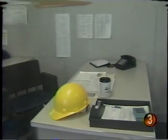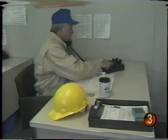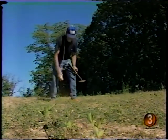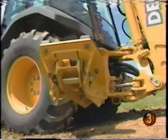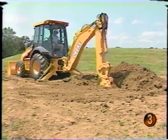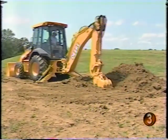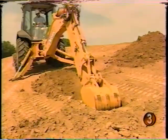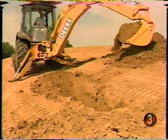Before starting work, be sure to call the utility services in the area to have the job site marked for underground lines or structures. In most areas there's a free or low-cost one-call locator service. It's better to take a little time before the project begins to know what you may encounter — if you cut through an electrical line or gas pipeline, you could be losing more than a little time. When setting up to dig, be sure the stabilizers have a solid base to rest on. To help prevent cave-ins, place the spoil pile at least three feet away from the excavation, even farther away if the excavation is deep. In loose soil, the spoil pile should be placed even farther away. When digging on a slope, place the spoil pile on the upper side of the trench — the machine is more stable when swinging uphill, and it makes it easier to backfill.